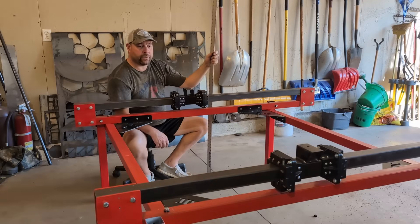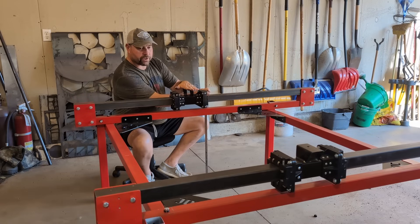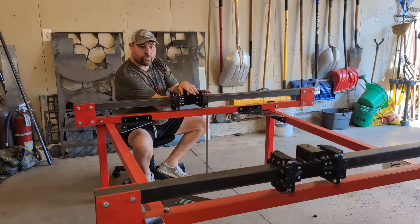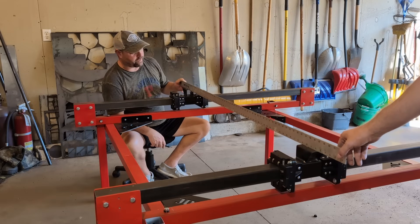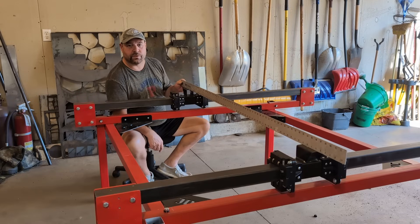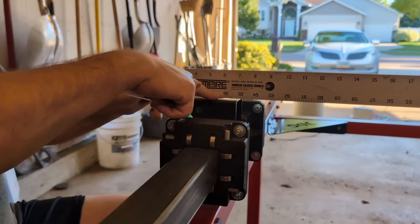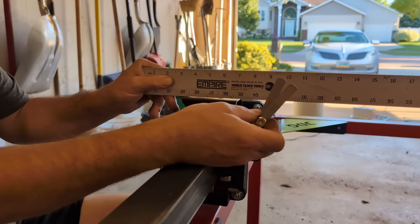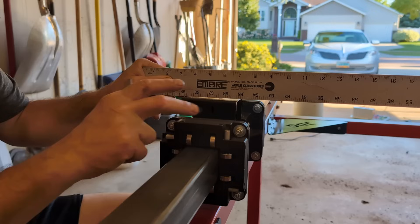What we need to do is set the angle of this gantry support — it's the same on the standard version. If your X-arm is pointing down, pointing up, not pointing in the right direction, we need to level it. We're using a straight edge, and they need to be parallel from side to side. If we zoom in, we can see we're really not very parallel. We've got a gap here — measuring it with a feeler gauge, it's amounting to about 1.1 millimeters. We need to make that level so when we bolt on the gantry it's not putting stress on the bearings.